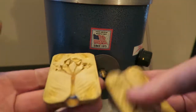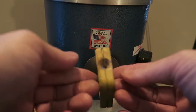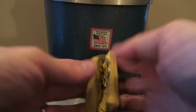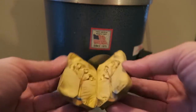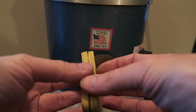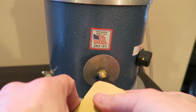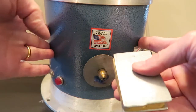So the idea is, this is the rubber mold that we have made. And inside this rubber mold was the metal master of the 4 links. Split the mold open, put locating lugs in the corner so it fits together nice and neat. We inject wax into this hole. It fills up the empty void that we've got there. Put it between 2 plates as we've got here. This is a chamber that is under pressure. We put air into the top. There's molten wax in here as well.